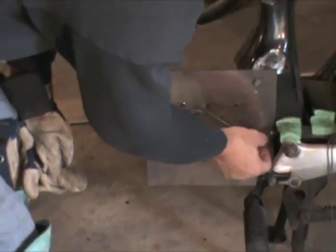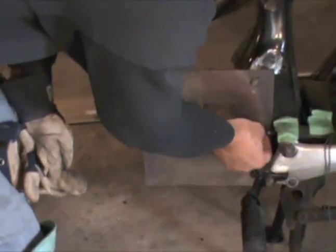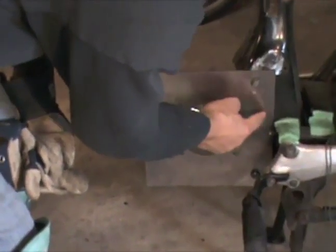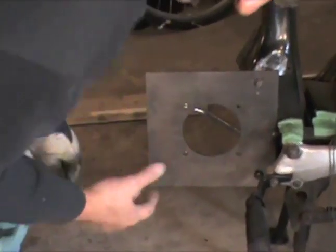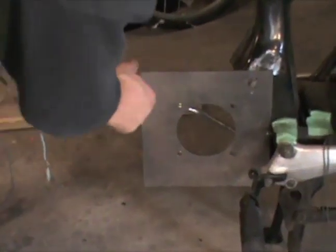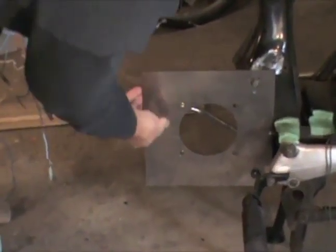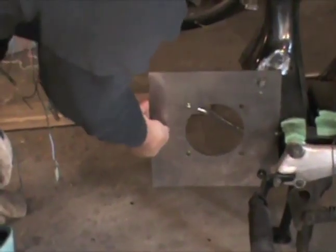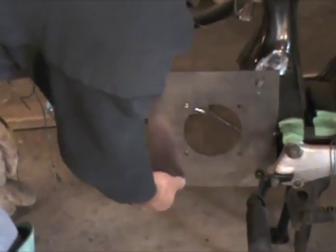I can put a chain on and have a look. If I wanted to put another bolt straight through here, drill it after the plate's in because it might be a little bit up and down. You drill maybe a bolt or two in here afterwards to make sure it can't move. I may have to strengthen the outside here somehow with a bracket out here, because it's got a little bit of a bend, and a bracket down here welded on.